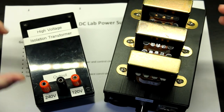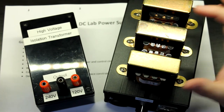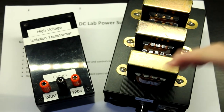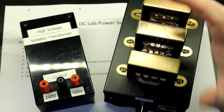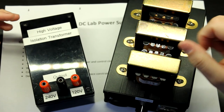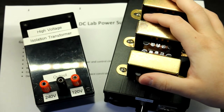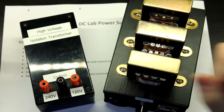This is not difficult. We'll be talking about series voltage regulators, series pass, like your 7805s, LM317 stuff. We're going to be designing something that's low voltage first, just so that you can understand the basics and how all of this works. Then later, we'll be designing an actual high voltage regulator. And from there on, we're going to be doing some interesting videos on protection, on current limiting, and all that sort of stuff. Very nice. And in the end, we'll have a finished circuit, just like we did in the previous one. And hey, a finished product if everything goes right.